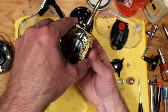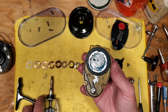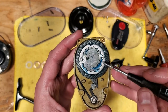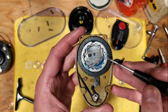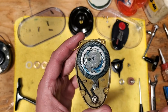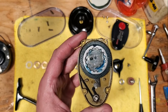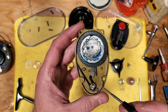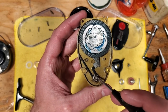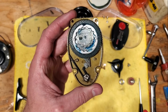At this point you should be able to gently pull your gear set out. What I do here is take out the main gear itself, this inner ring, and this wheel — pull all those pieces out, clean them up real good, and get them ready to be repacked with fresh grease. I also clean up the dog and dog spring area down here and apply a couple little beads of oil at the pivot points.